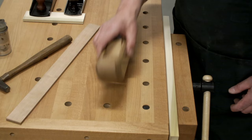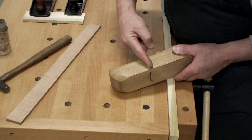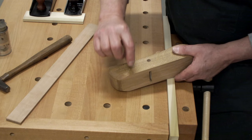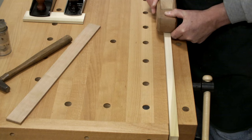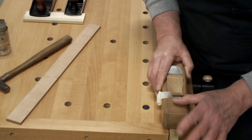So how come it is that we get a straight cut? As opposed to a power jointer, that has a split right here by the cutter, and your front table moves up and down and your rear table moves up and down — you adjust them just perfectly to where you're taking your shaving off the front and it's riding on the back. It's feeling. You have to have pressure on the toe, get the cut engaged, bring it forward through the cut, then start to let go on the pressure here until as you're exiting the cut you're almost off.